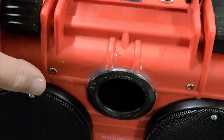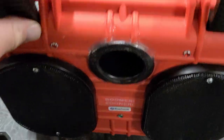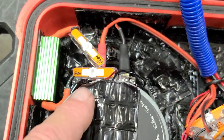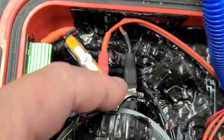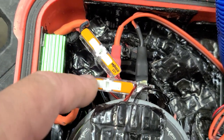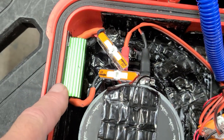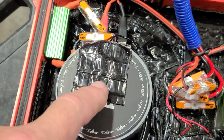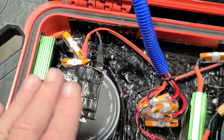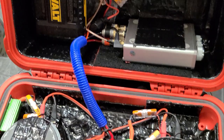Let me go inside and show you what I did. I had to put some screws on these grills because they keep popping off. The tweeter wires go down to the standoffs, and they left me enough wire to wire in a 50-watt 30-ohm resistor in series with the tweeters. That knocked the tweeters down substantially, balanced out the woofer and tweeter sound, and just made it sound great.